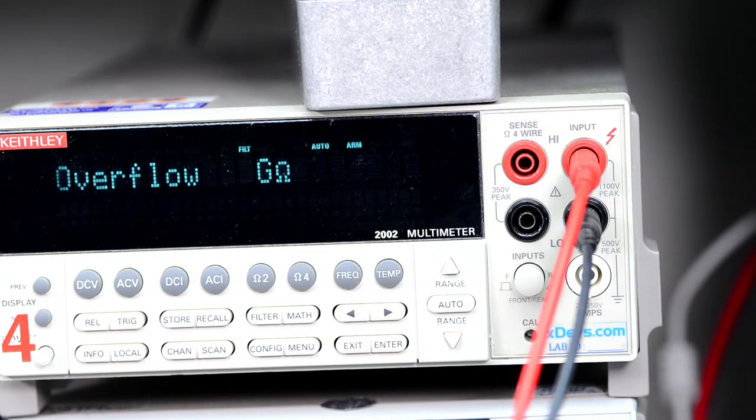And let's check the trim pot. So across the far terminals, 10.61 something, and across the far and middle 5.64, and middle and near 5.141. We can actually adjust the new trim pot to about the same value. So let's see that. Oh, interesting.